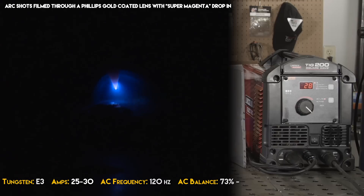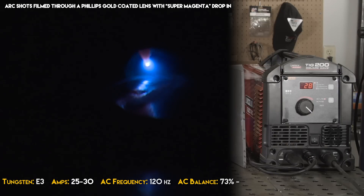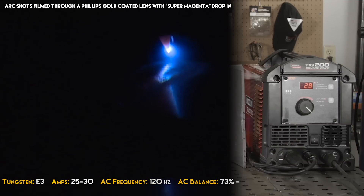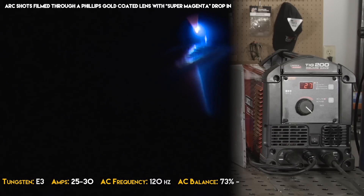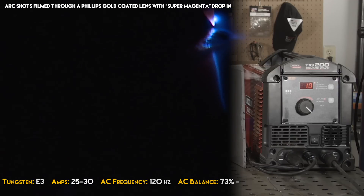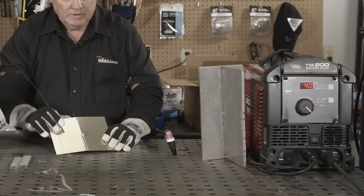This material is really thin and very sensitive. What's going to happen is the heat's going to catch up with me, and I may have a tough time controlling it. If you're doing thin sheet metal, it starts off okay. If you don't have plenty of tacks in there, it's liable to overlap on you and you'll lose control of the puddle. This machine, as I was telling you, lights off at 10 amps, but it's actually a pretty hot spiking 10 amps. I'm going to try to taper off. Didn't do too bad this time — not bad at all.